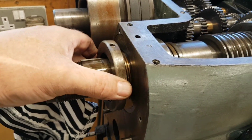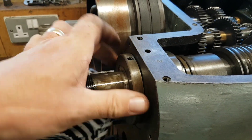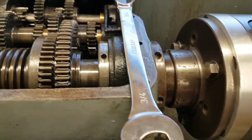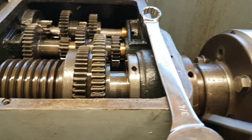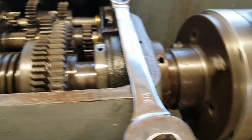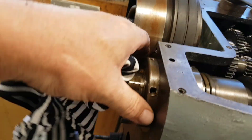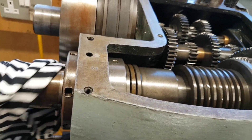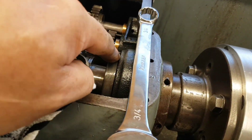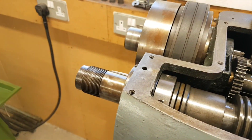So the simple setup with this is you drop the ring back on and pull up so it's relatively hand tight, making sure that both locking rings on this side are slack. Now I don't know if this is the correct procedure or not because I'm basically making this up as I go along. So this turns so free now it'll just freewheel - I'll take the key out otherwise I'll smack myself in the head. The natural progression is to tighten this one until there's resistance on the shaft, then lock it with that ring, and repeat on this side - tighten this one so you pull the bearing inwards into the taper and then lock it in place.